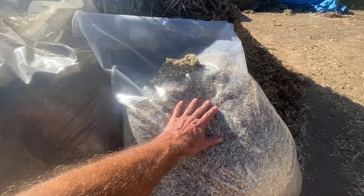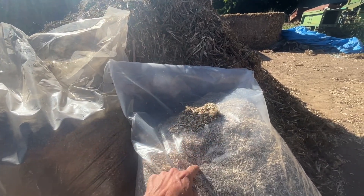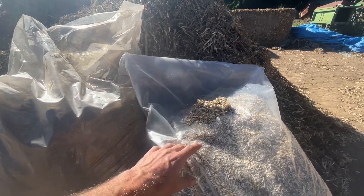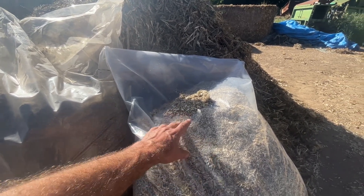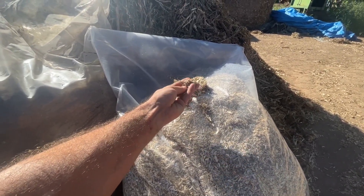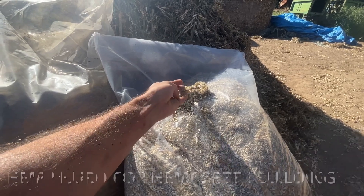Here is a bag of hemp building material that gets mixed in with a bag of lime, water and sand, and that turns it into a crete. The silica content from this hemp bonds with lime to form a stone of sorts. While it's called crete — as in concrete — hempcrete is a little bit different to concrete, but it is formed in situ and you can make all different kinds of shapes out of it. Once those shapes are formed it starts to dry, cure and harden.